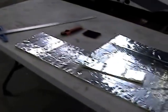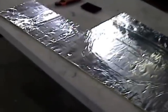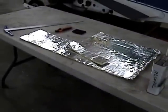I mentioned the stuff we put in there for backing, called it Y370. It's what it used to be called. It's a different number now, but it's made by 3M, and it's a quarter inch thick dense, closed cell foam, called vibration dampening tape. This is the stuff that you see throughout the fuselage and the wings and various other places that the factories used it for. Exactly what we did is take areas that are prone to oil canning and peel the back strip off and stick this stuff down in, and it stops that, and it stops vibration.